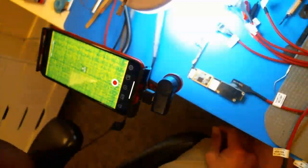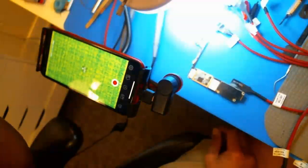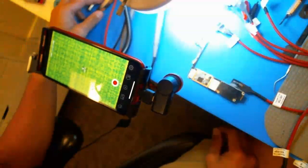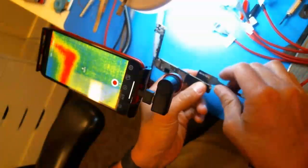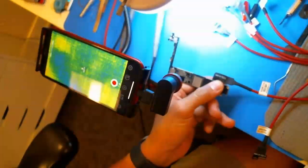With that said, I will say that I have solved some issues with this thermal camera that I don't think I probably would have solved with freeze spray. Like an iPad 10.5 — I just checked all the common shorts and couldn't find it. I put it under the Seek Compact Pro and boom, the cap heats up so quickly and tells you exactly where the fault is. I was really pleasantly surprised — it was like a $200 repair, so that pays for itself.